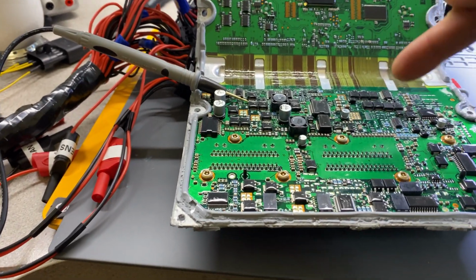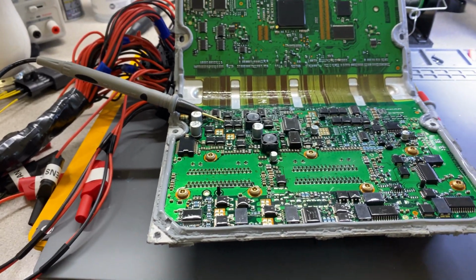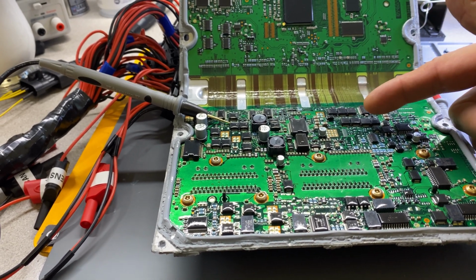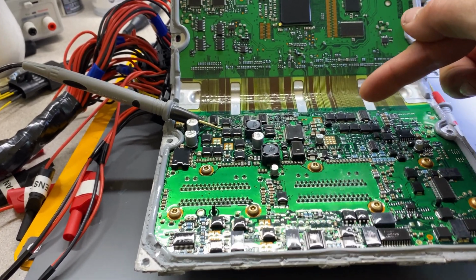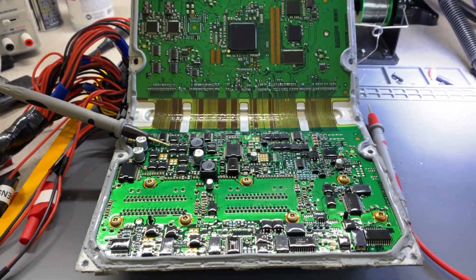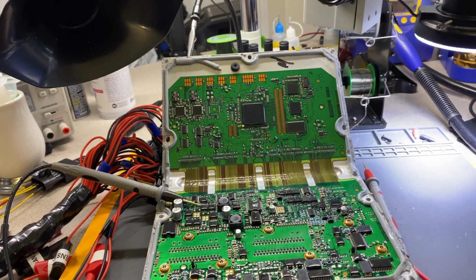And I just follow the paths and find out which one goes to the capacitors in here. Then I test the capacitors, make sure they're not shorted. I go down to the two MOSFETs that we have here. Those are N-channel MOSFETs, and I check them too. And then I follow over to the TPIC46L02, which is a prefet driver. And I have also the information for that.